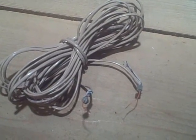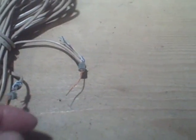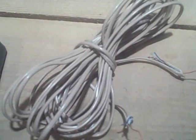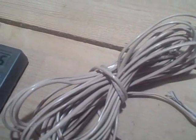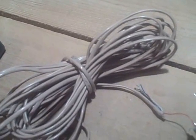This is a 25-foot coil of telephone wire and I'm going to measure the resistance of one of the wires. See this red wire? It contains four wires. All you're going to need for a thermistor is two of the wires. The resistance of this 25-foot bell telephone wire is 1.5 ohms. That resistance is so low that it doesn't make any difference as far as the 10K thermistor probe is concerned — it's an insignificant resistance. So it's very easy to use and very inexpensive. This is the extension wire I recommend you use for your temperature probes.